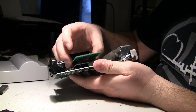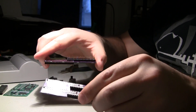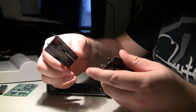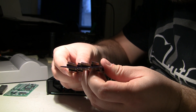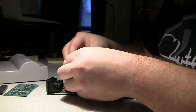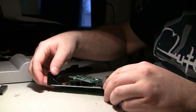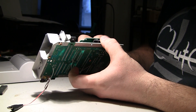I have two different boards mocked up, because these are the header pins I have on hand and these are the header pins that came with the NES RGB kit - they're just a hair shorter on the standoff. I wanted to mock it up with both to see if I can get away with using my headers. You can tell it stands up quite a bit more with mine.